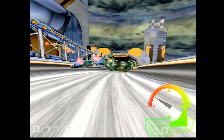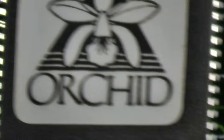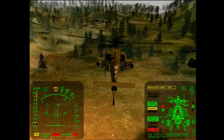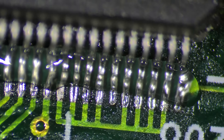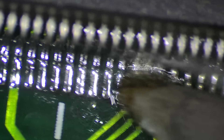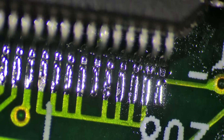I think this was a total success — we fixed both Voodoo cards. The Righteous 3D from Orchid was just a few pins around the TMU chip, which is one of the most common faults on these cards. On the Voodoo 3, we only had the mess with the memory — everything else is perfectly fine, and that card should last for a very long time. From this repair, we can see that without proper magnification and proper tools, it's almost impossible to do a good job — even though these are not the smallest components, you will not get a good result. The worst part is when you make it worse. I'm very happy I was able to rescue these two cards.